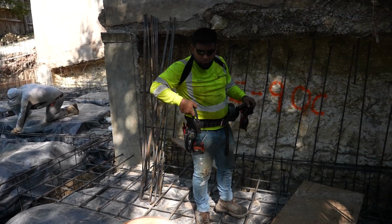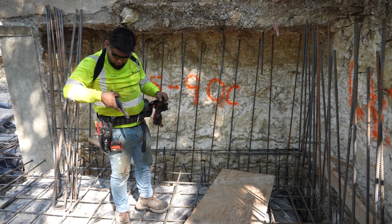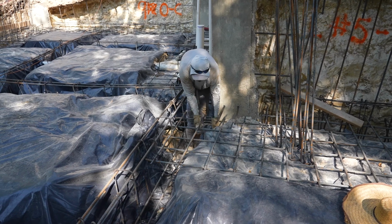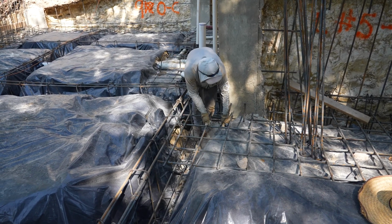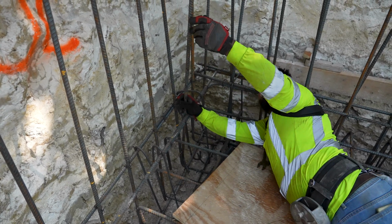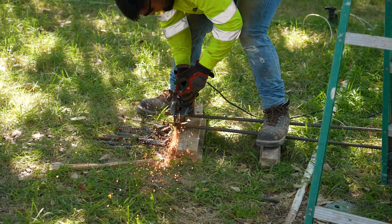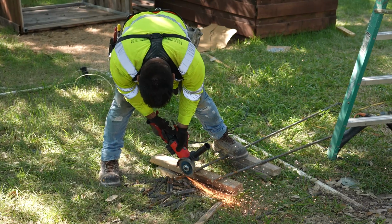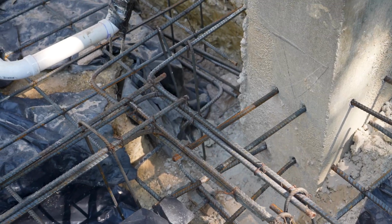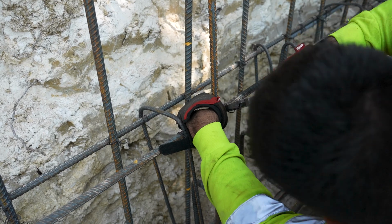So once we get our poly down, we can get our rebar in, and that's called a rebar mat. At the top, it's just a thin layer of rebar, but it goes down into the grade beams. So the guys have to form what's called stirrups, which is basically just a loop around different rebar to make up those sections of the grade beam. The rebar is what holds the foundation together. It's basically like a webbing that keeps all the concrete together, and it's very important.